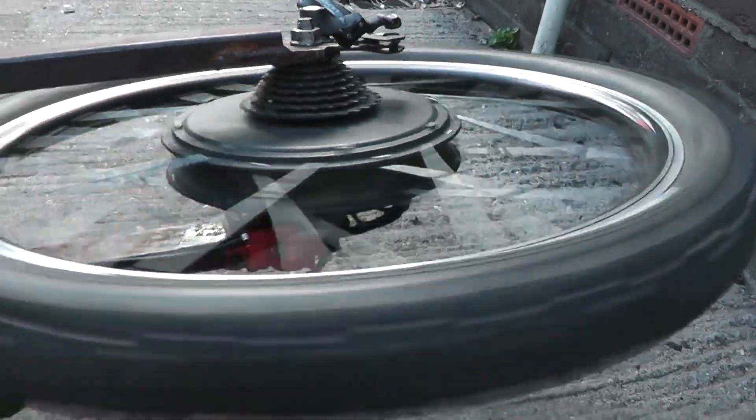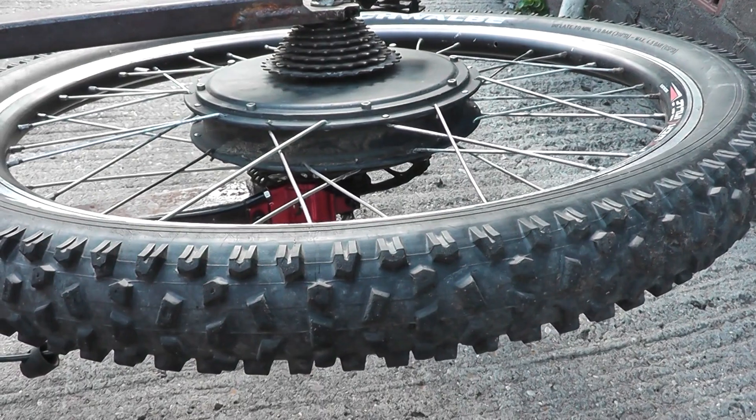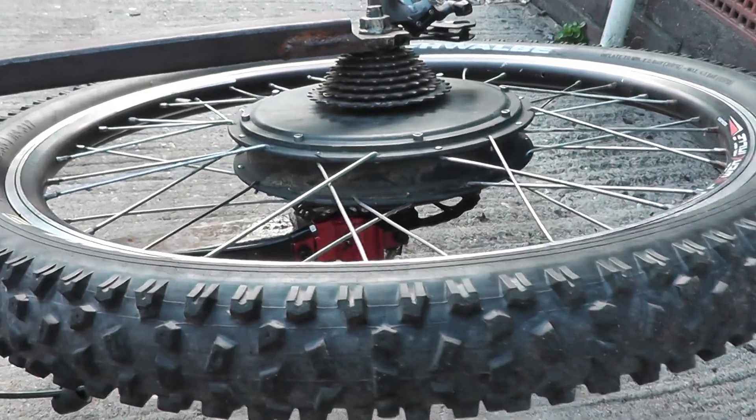It's essentially a bit like a controller failure where you'll feel it cogging and beating really badly, but it's not a controller failure — it's actually the windings in the motor.